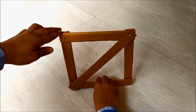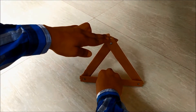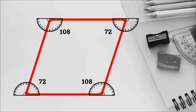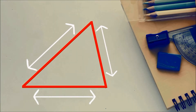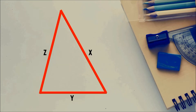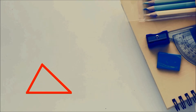Now this is more strong and stable. Or if you make a triangle from three pieces of cardboard with pinned connections at their joints, when force is applied, you will find that this is more stable and stronger than the square. The reason is that squares are made up of four sides, and you can change the angles to get any quadrilateral shape with those same sides. But triangles are different — having three sides with fixed length, you can't change the angles to get a new triangle with those same sides, as there is exactly one triangle that you can make from those sides. This is how triangles hold their shape.